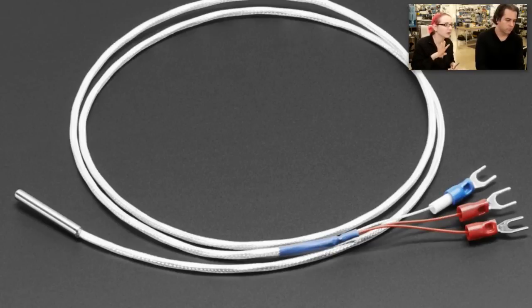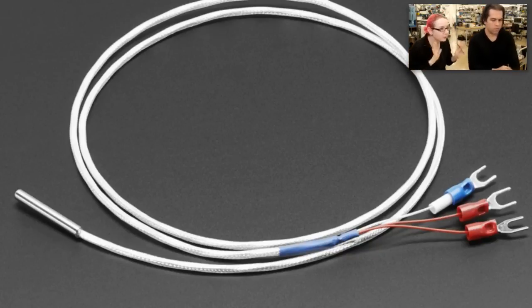Sometimes you can get sensors with four wires, but honestly it's not going to be different than two times one wire — you'd have two force and two sense. In my opinion, if all of your wires are the same gauge and length, you're not going to gain anything by having another wire, which is basically a duplicate of the third one. So I'm a three-wire kind of person.